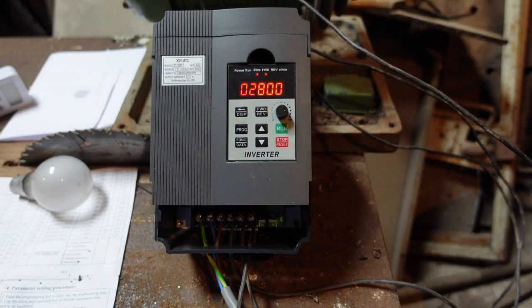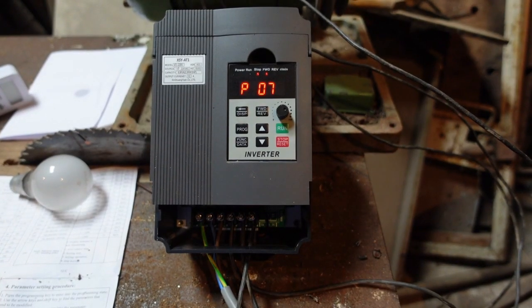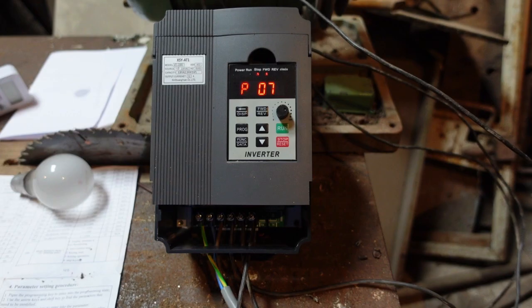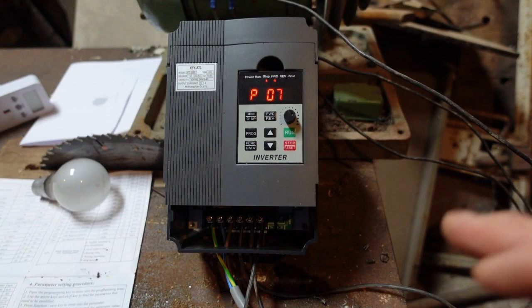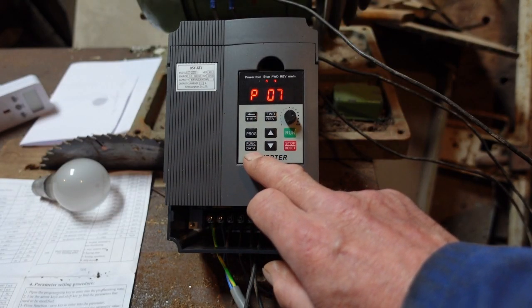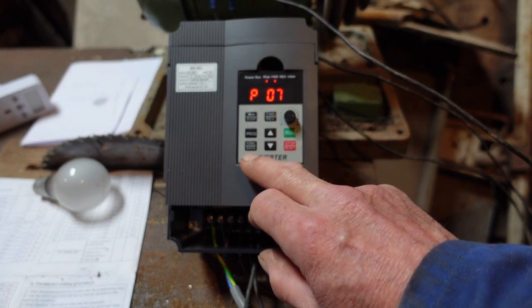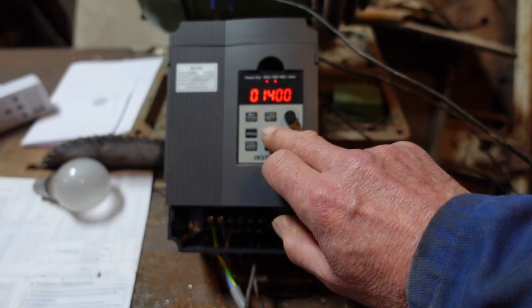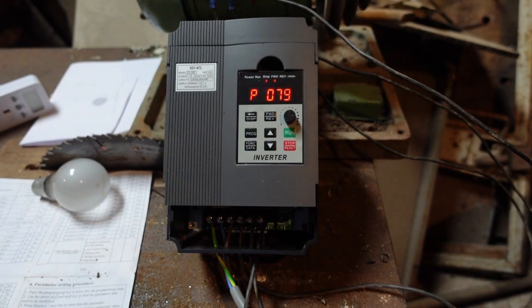It's previously been set for a 2-pole motor. The last one we need to set for this motor is the main current overload, which I believe is the full working current of the motor. It's set in milliamps and the default is 3000 milliamps or 3 amps. We get the value off the plate on the motor — 1.45 amps. The thing will work at 3 amps but there's no point asking the VFD to send more current than it needs in a fault situation. I'm going to set it at 1.5 rather than 1.45.